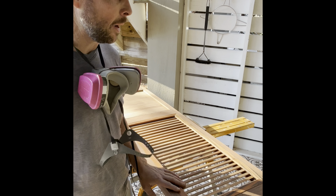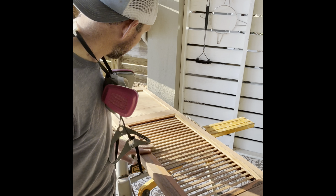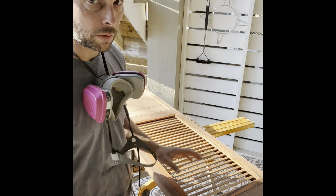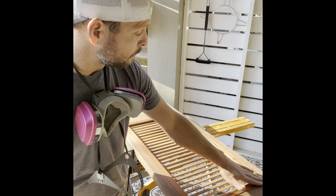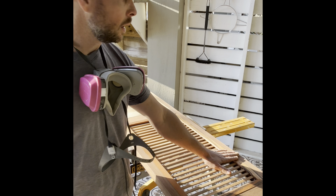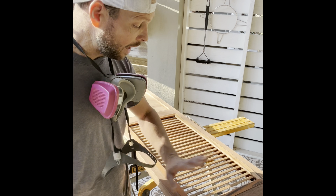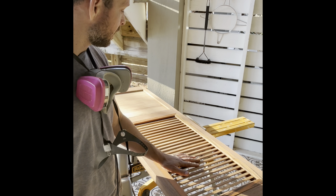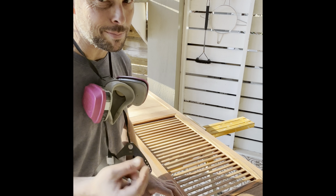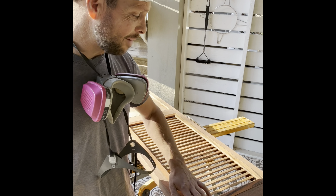The only thing I'm going to sand is the frame — there are a couple of saw blade marks and it sits a little proud, so I'll take the sander and get it nice and flush. One door is completely sanded. I'm going to initially hit it with the belt sander, being careful not to mar the wood, just hit the real high spots to remove material quickly. Then the palm sander at 40, then 80, then probably 120 and we're done.